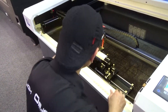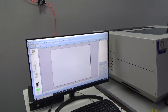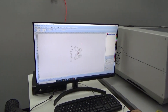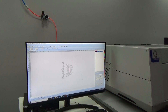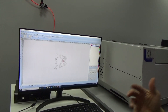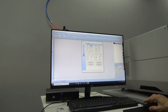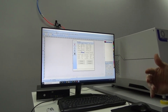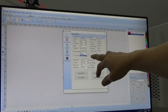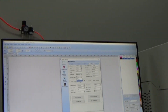Now let's open the application — LightObject. I already have a file set up for the rotary job: it's a butterfly with our brand logo, to make a label for the wine bottle. Before using the rotary, there's one more setting: click Settings, go to the U-axis section, and choose what kind of rotary you want to use. There are two types — the chuck/clamp type and the wheel type. For this video we're demonstrating the four-wheel rotary type, so we select that.